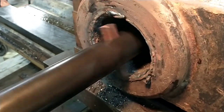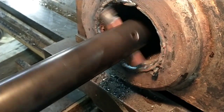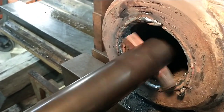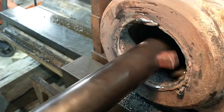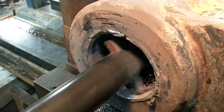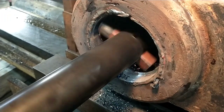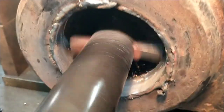We welded her up. We had to do a bunch of hand welding because the bore welder didn't like some of what was in the hole, and this is our first attempt at taking a shave through there — we'll see if it'll eat this or not. It's a pretty healthy cut, so I'm not sure if we're going to get away with this. We're through the worst spot now, hopefully she'll just carve her way on through. We've got a big goober in the weld there — another spot the bore welder had a problem.